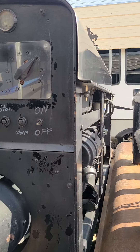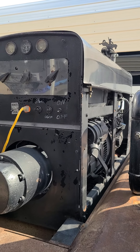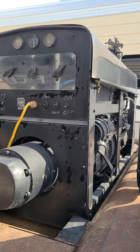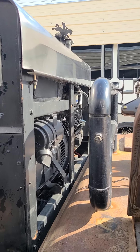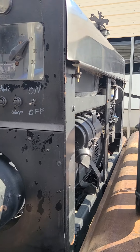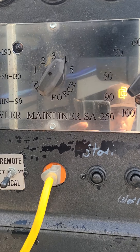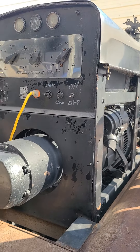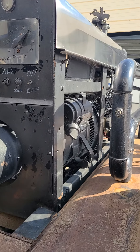It was an SA-250 with a Perkins engine in it, but it got taken out, put in a 70-model frame. It had a three-cylinder Yanmar put on it with the seven-range selector, with the five-range selector for the arc force. Chopped five inches, shortened six inches - I believe maybe seven inches, I'm not sure.